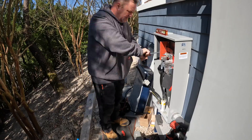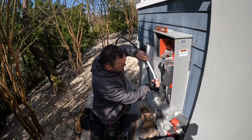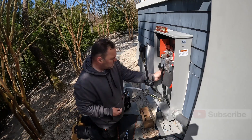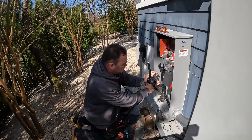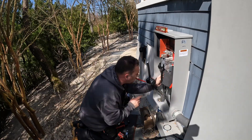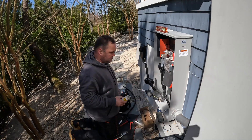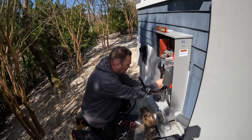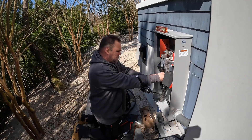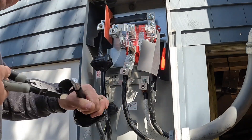There was no lapse in service. They do have a standby generator here — it's a 400-amp disconnect you see right beside me on the right-hand side — but there was some error and the generator never started when the power went out. It's a natural gas generator, very loud, but it never came on. Now they can have it serviced so it will kick on when they actually lose power. So that's the story of this job — a lot of i's to dot and t's to cross. I've extended the line side conductors because the new enclosure is two inches longer.